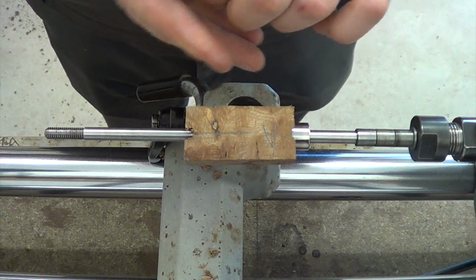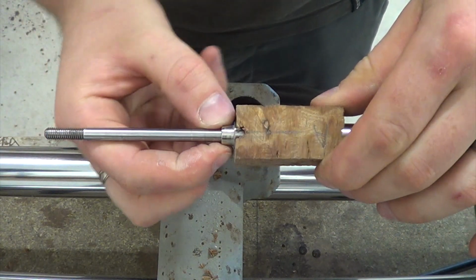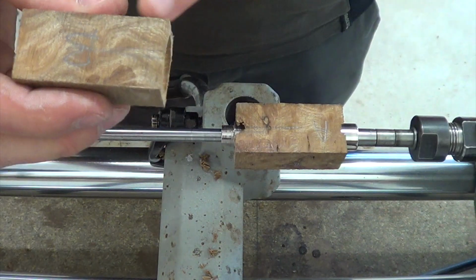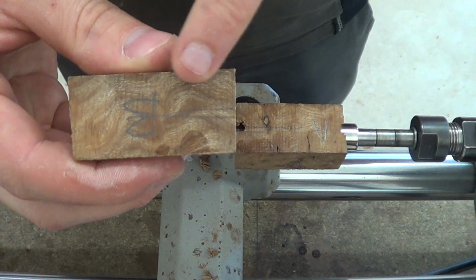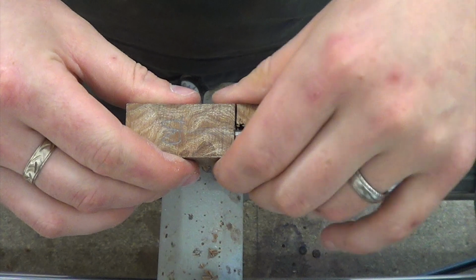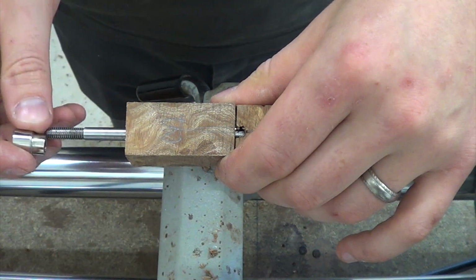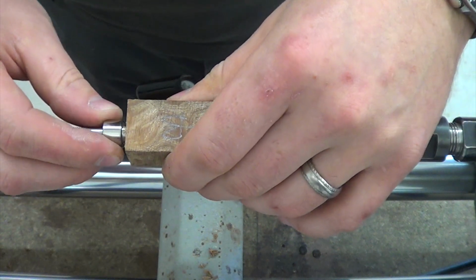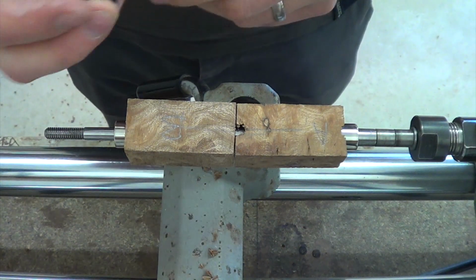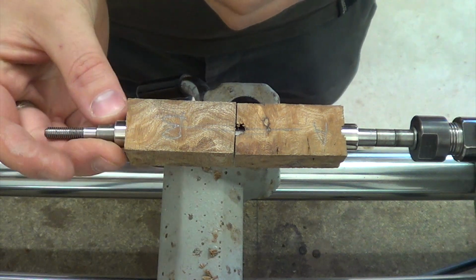So you put the first one on, then the middle section goes on, make sure it's pushed inside the barrel, then your second section, and you want to make sure that the markings that you put on match up so that you know that the grain is running as it should. Then finally your last kit bushing, it goes inside. And then you want to put on a few more spacing bushings up to the thread of your mandrel.